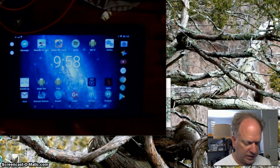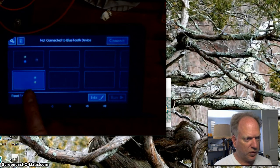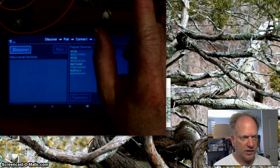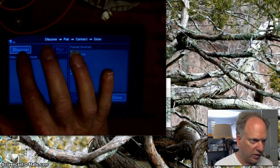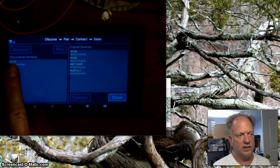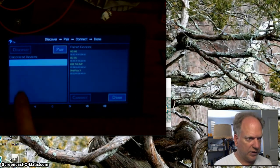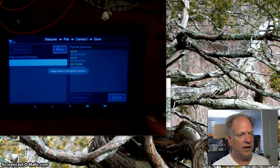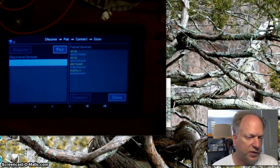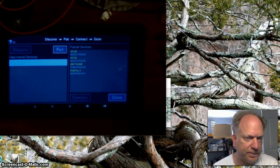It's called Bluetooth Electronics. And if I open it up, you can see the funny spelling of cool. So go there. And we're going to build a little application here. But the first thing we've got to do is connect to something. Now remember, I've got this guy flashing. So we could go ahead now and discover. And you can see initially when I did this, it just gave me an address. It didn't say HC06, okay? I just saw an address across the bottom. But I went ahead and I clicked on it, and then I paired it. And then it did figure out, oh, this is an HC06, and it asked me to enter a password. All these things have a password of 1, 2, 3, 4. Super easy. Now I've already done that.